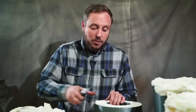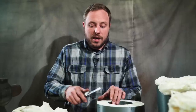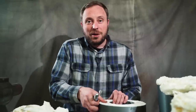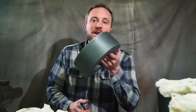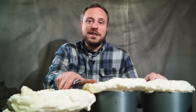I did the fiberglass and the foam on this piece first as a test because I was concerned that the polyester resin for the fiberglass might melt the plastic, since PLA does melt at a low temperature. Fiberglass resin is a two-part polymer that you mix together — it's an exothermic reaction and it gets warm. So I had to keep it cold in the garage to make sure it wouldn't warm up enough to melt the part. I did one and it worked wonderfully, so I did these three also.